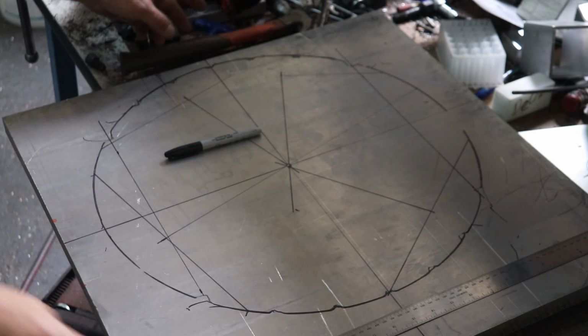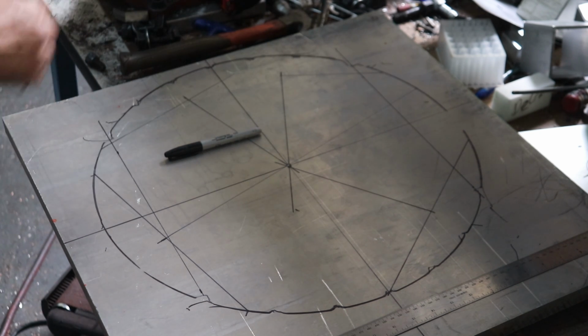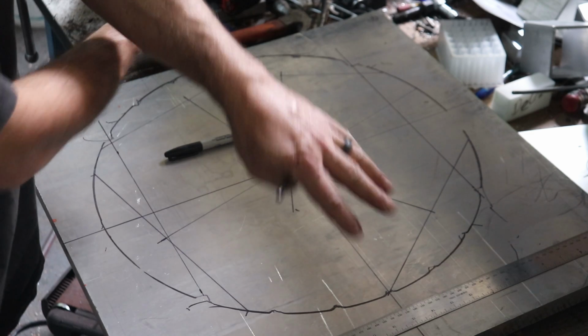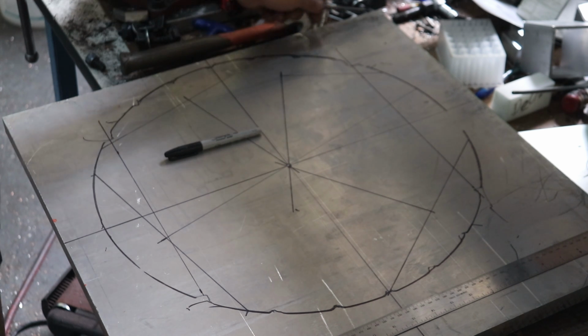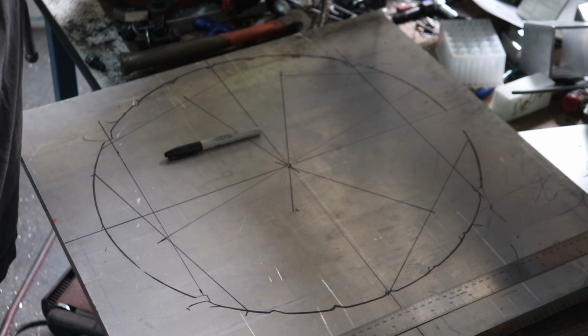Okay, so this is the fixture plate that I'm adding to the Haas 5-axis UMC 750 mill. And what I did is I laid this plate over onto the round table of the mill itself. This is the gimbaling table. And the origin I set to be here, and basically this corner, as I set it on the mill, I have it 1/2 inch in from the machine's absolute travel limit. That way, if I ever need to edge find or find the zero, I can do that with extra space.